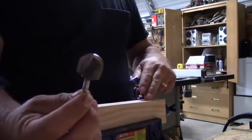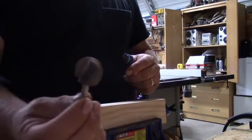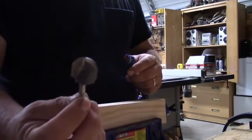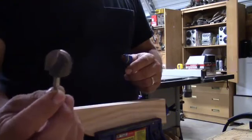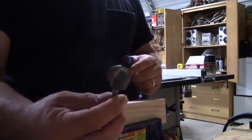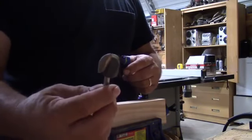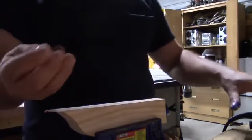This one I think is going to be a little bit too big — I've been experimenting with the Harbor Freight router and I think the grooves are going to be a little bit too wide. This is a one-inch bit; I've ordered a three-quarter inch, and I think the three-quarter inch will actually be closer to the original grooves on the antique dresser. But for demo purposes we're going to use this one today.